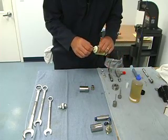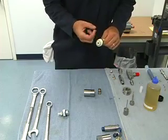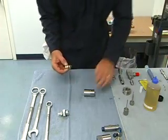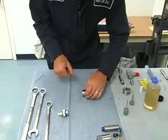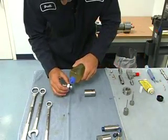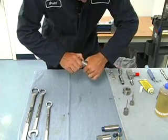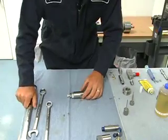I want to put some Parker Lube on there, and that's going to hold it in for us while we're assembling. I also like to get some Parker Lube and wipe it on the whole piston here, on the O-rings and everything. We slide it in with the insert going down away from us and push it in with our thumb. Next we have these adapter fittings — we'll lube the O-rings on those and screw them into the hydraulic housing. We want to tighten these down with a wrench as well: one and a quarter, and that one and a quarter.